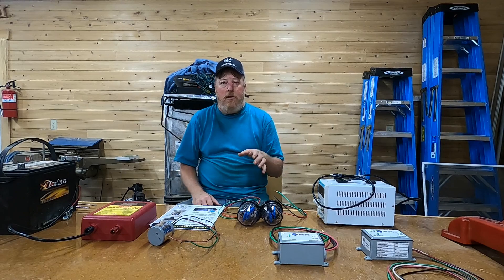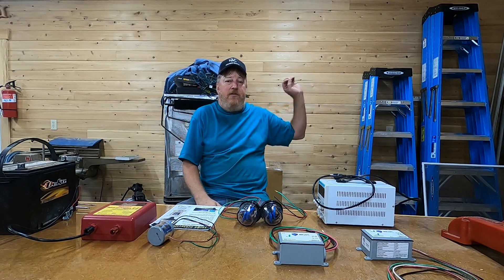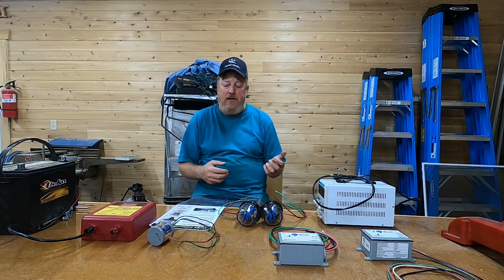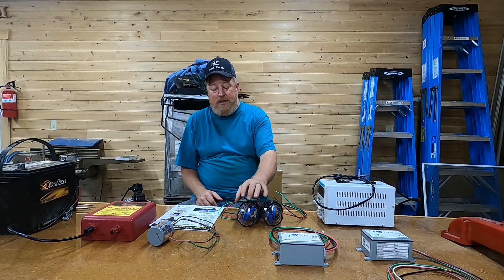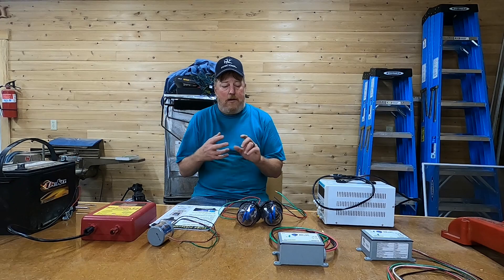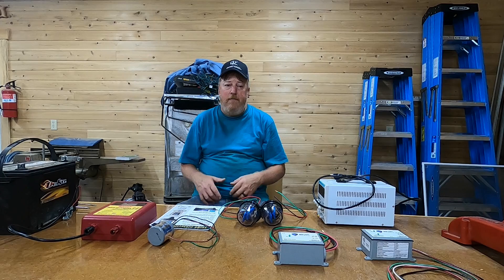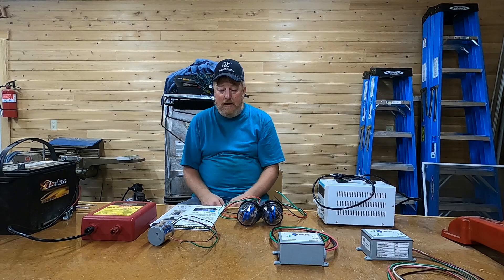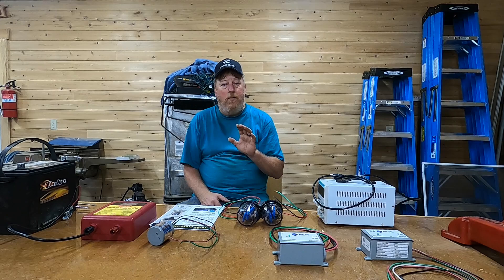There's a lot of stuff available. You can go to your local electrical supply house and ask them for a Square D whole house that goes right in the breaker box — it looks just like a breaker. There's a Cytel one that goes on the side. Pretty much every one of those is just like the Midnight, where it uses metal oxide varistors, MOVs. They all basically do exactly the same thing. It all boils down to how much MOV they have and how good they are, or how high the voltage the MOV conducts at.